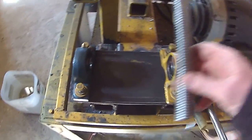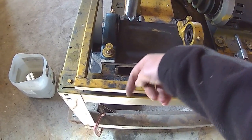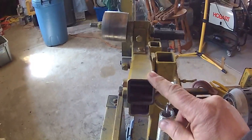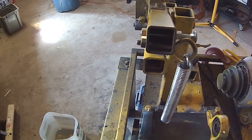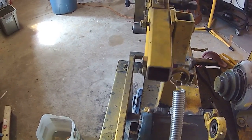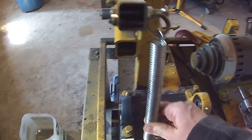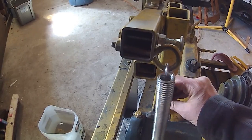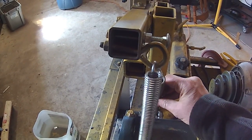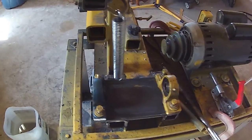Those will go down on there. I'll put a little extension tube out here made from this material — I'll weld it in there and put an eyelet on there so I'll have a tie-down for my tensioning spring. I'm also going to put a second tensioning spring up here so I can get the right tension at high speed.